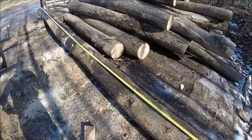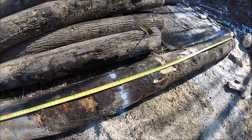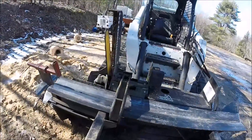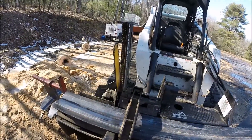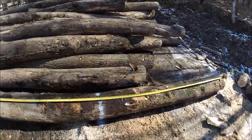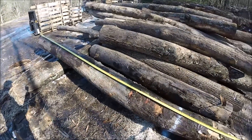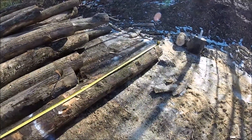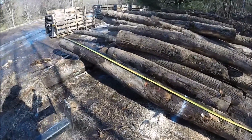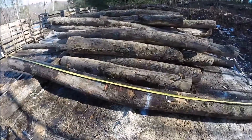What I like to do is when I'm sitting in the cab, kind of look at the log and picture that 10-foot length range. Then I like to take that when I pick it up and roll it right in so it meets up to the saw bar. As you cut it off, the extra piece will land on the ground. You will be left holding this piece on the tray table and you can go through and process this. Then when that's done, you come back and pick up that piece and run it straight through. The processing unit itself will not hold all 18 feet of the log, but it will tolerate between 10 and 12 feet on a pretty common occurrence.